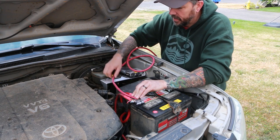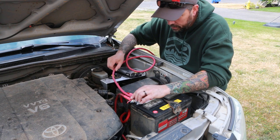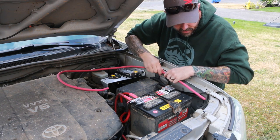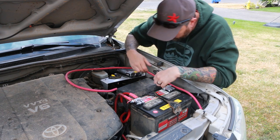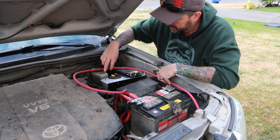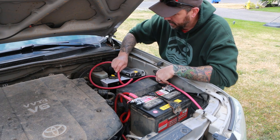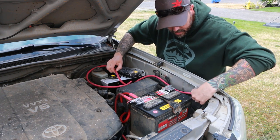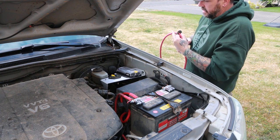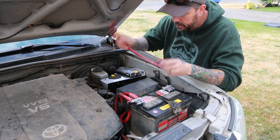If you're not going to be doing a dual battery setup or having any modifications to your battery placement, just run the circuit breaker cable around your engine fuse block to the terminal. Me, I'm personally going to give myself considerably more length because I'll need to come up here — running from the front around this fuse box to the underside. We can always tuck away extra cable if needed. We'll go ahead and cut that and then attach our ends.